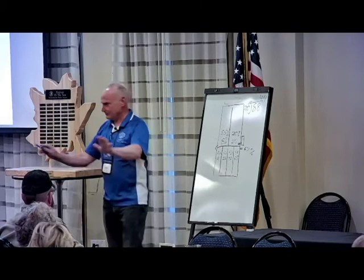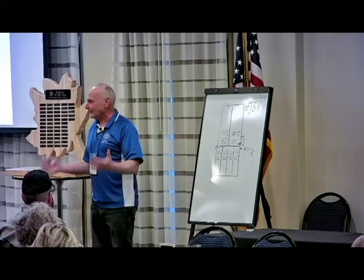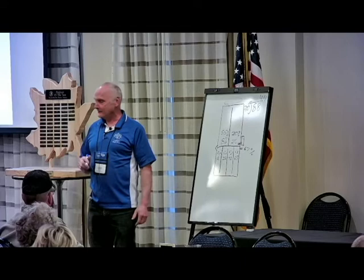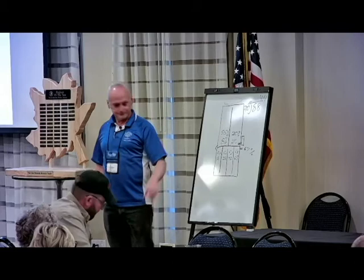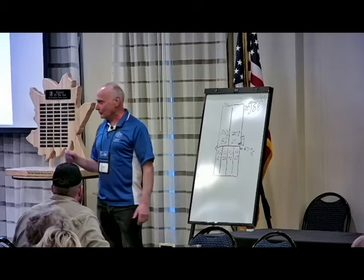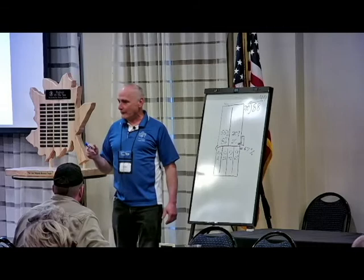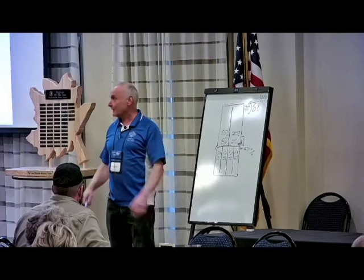66. You see everything's really working the same way, but here's what we're going to notice. If we had trouble making syrup in the middle before, we've just compounded that problem in a big way. Because the difference between these two numbers and syrup ain't much. So we have to be really watchful. And that same old scoop that Grant used, we can use today, and reach in there and test it and see what's coming along. Or we can put a thermometer probe in there. If you've got cross-flow front pans, there's thermometer ports in those pans that you can put thermometer probes in and know exactly what's coming along at you.